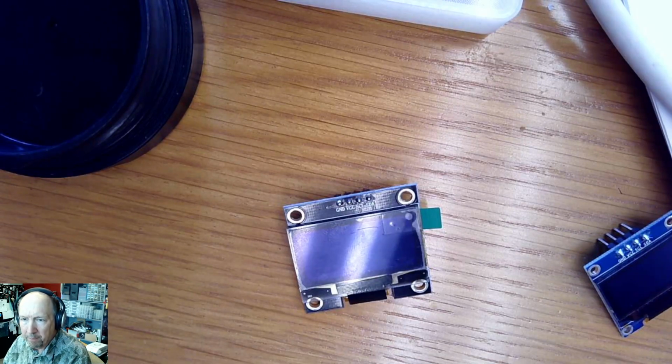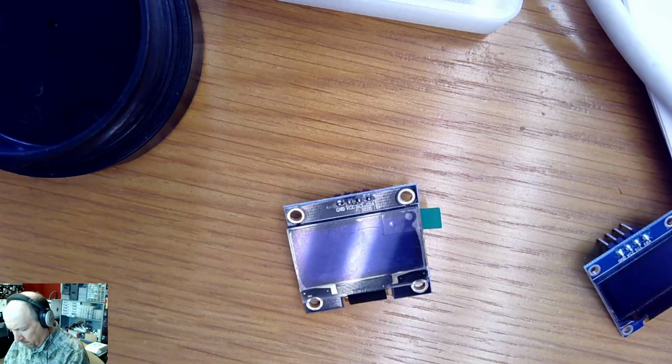Wire that in. You know, if the ground was actually on the bottom, that would be more convenient for me. So let me just undo that for a moment, and let me take this connector, right-click on it, and mirror it vertically. That flips everything for me, so that now pin 1's on the bottom, and that'll work out a little smoother for our schematic here.